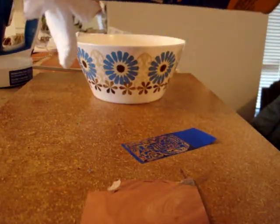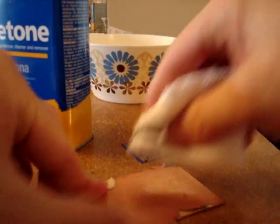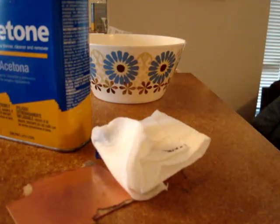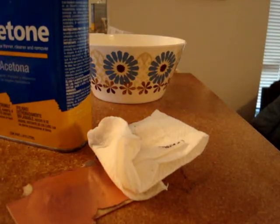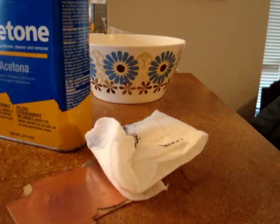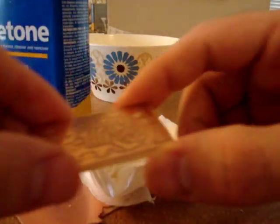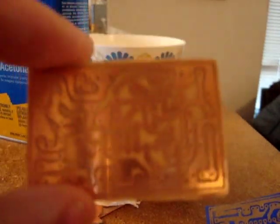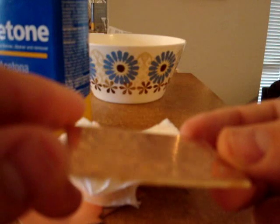What I'll do is I will finish cleaning this up, reapply a circuit to it, etch it, and it'll show you what you get after you etch. Here it is — after I etch that circuit, it comes out looking like this. All those traces that came off of here onto the board — put it in the etching solution and it protects all that copper from etching off. So now you have a circuit board.